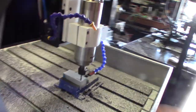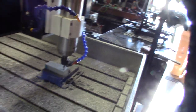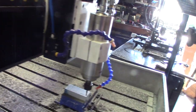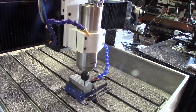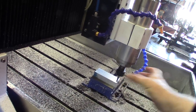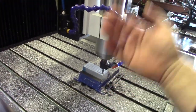So I thought, what if I design a clamped-on thing where I can adjust it with a screw to change the height? That way I can bring it down to where I need it. I need to be able to take it off to change bits or adjust it. What I was thinking is to 3D print something like a collet to grab onto the spindle, then maybe use a 2-liter bottle so it's clear. Instead of being 100% 3D printed where you can't see what's going on, make it out of a 2-liter bottle — clear PETG, polycarbonate, whatever they use. Just cut a slice off, put a ring adapter on the bottom to keep it from bending around, and an adapter piece so I can screw up and down. Hopefully that will pick up a lot of that debris. I have expensive coolant in there and I don't want to be losing a lot of it.